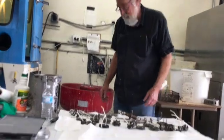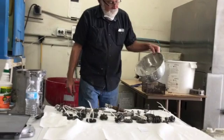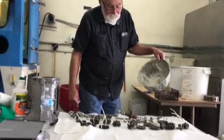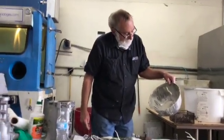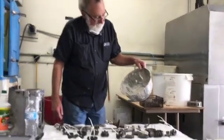What I'd like to do next is show you what we use. There's a couple ways of doing isotropic finishing. We're using a paste now. There are two stages on the paste. This is kind of like a fine toothpaste that we're using.